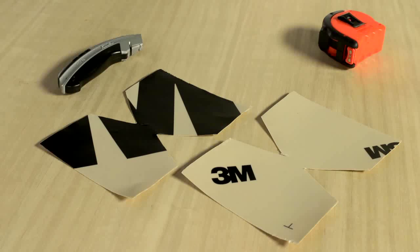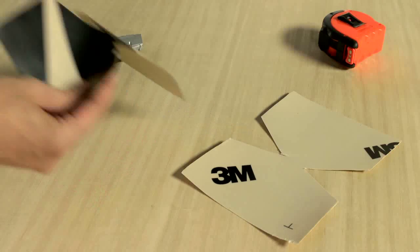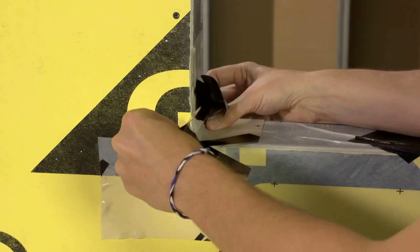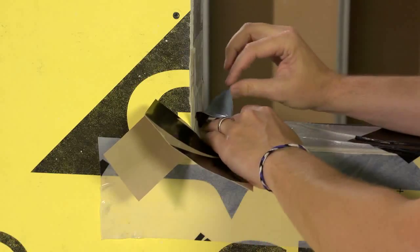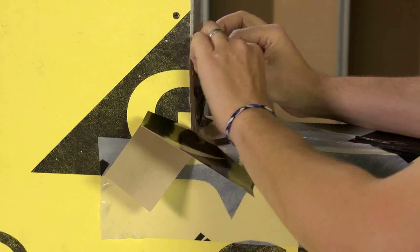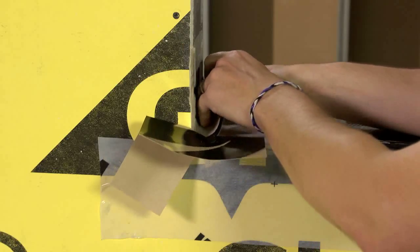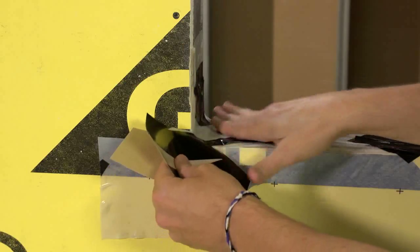For reinforcement in the corners of the jambs and sill, cut detail strips of membrane that will allow a 2-inch overlap over the exterior face of the wall. Peel back half the liner and position the strip in the corner so that 2 inches rises up the jamb and 2 inches extends across the sill. Press the membrane securely into the corner.